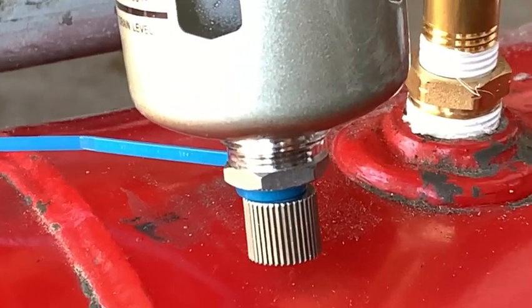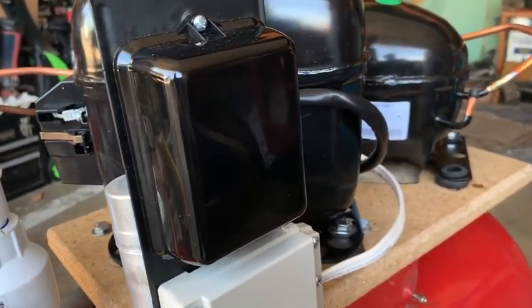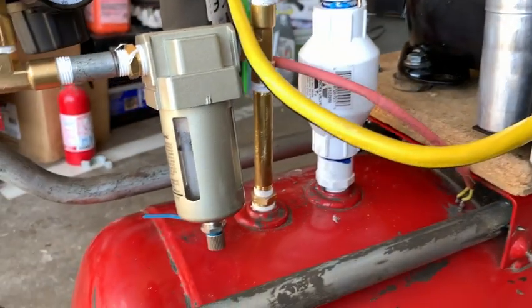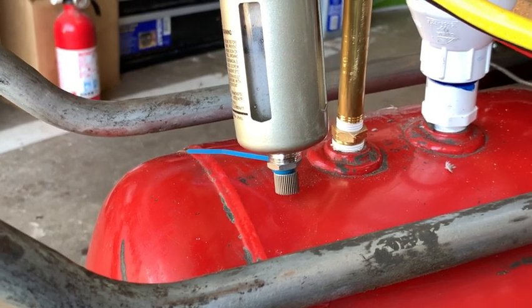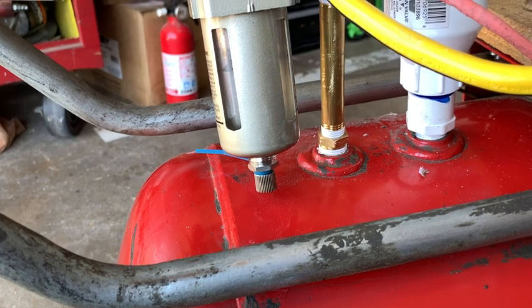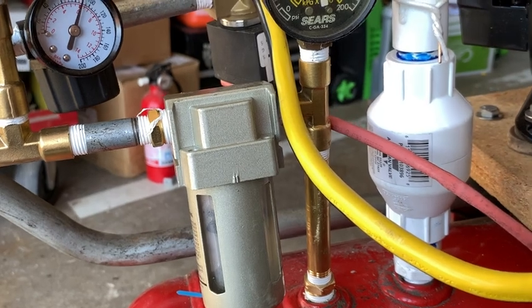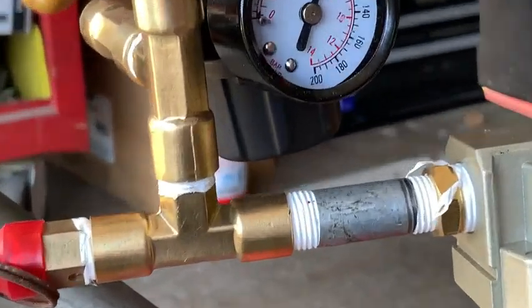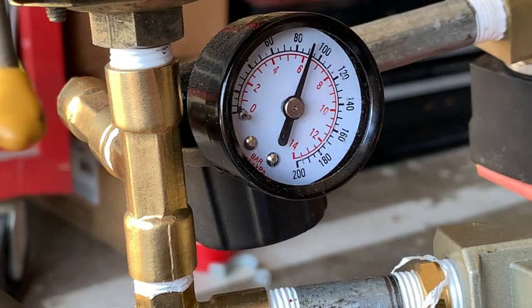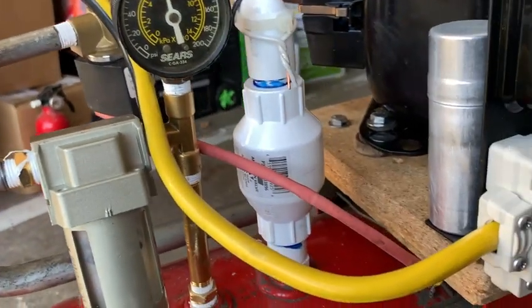I still have not tested whether the new compressors can fill the sediment chamber quickly enough to close that valve, so the zip tie still remains. Next, we have a quarter-inch brass pipe fitting threaded directly into the tank as the outlet, connected to a brass tee fitting, which goes to the original pressure gauge, connects to the catch can, into the tee fittings, then to the regulator valve with another pressure gauge, connected via quarter-inch steel pipe to our solenoid, which goes to the air atomizing aeroponics nozzle.